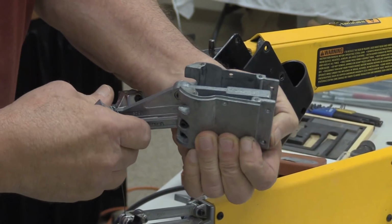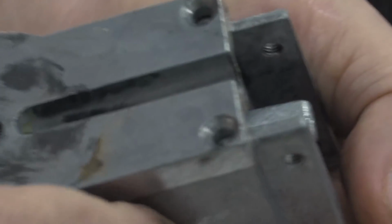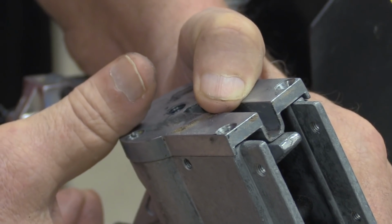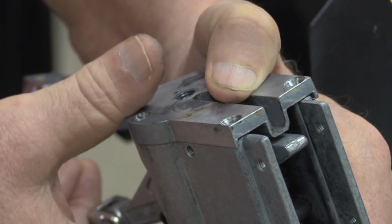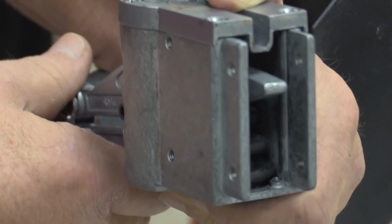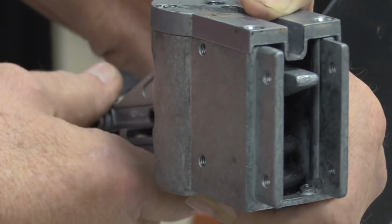You notice when this part operates, this arm moves up and down. With this plate on top, you'll notice what happens there when that counterweight comes up to the bottom of that tensioner plate. If you've got things adjusted in your saw to just the right condition, where you've got this tensioner rod turned in maybe two or three extra turns, and you crank the speed way up, what you get is some overthrow on this counterweight, and this counterweight will go up there and smack that plate.